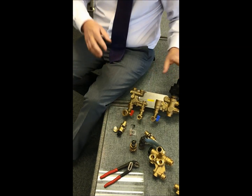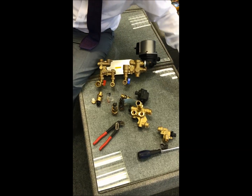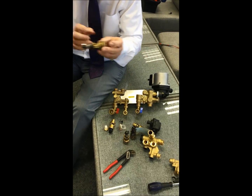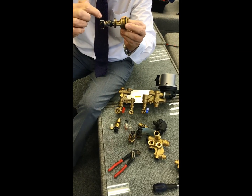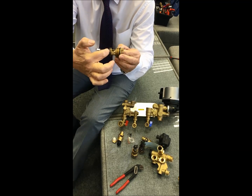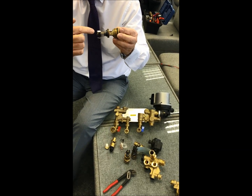Now, once we're sure that we've got the red light and we've got power to the diverter valve, the actual diverter valve mechanism, from this being the diverter valve many years ago, this is now the diverter valve. And how this operates on this particular valve: when the motor closes, bump. This seal here closes the central heating return, so stops the central heating, the space heating. Here with another seal, that seal opens to supply the plate-to-plate heat exchanger. And as it retracts, it closes the plate and also then opens up the space heating to allow the central heating to operate.